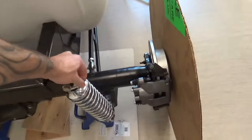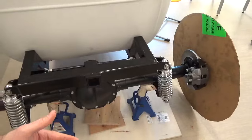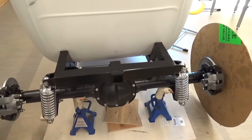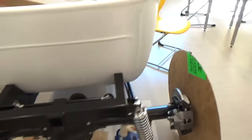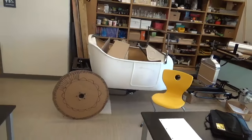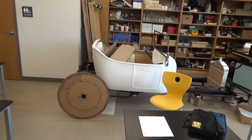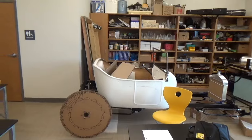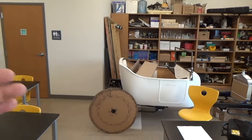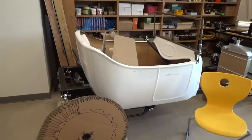The bedside is going to fit over here. You'll have access to the shock adjustment here — it'll come right out. The bed floor across here, we're going to bring it out a little bit, and that's where we're going to decide how far out we're going to come back from the back of the car. From the side profile of the car, we don't want the car to get too long, but we mocked up a tire out of cardboard to get an idea. That's about the size diameter tire we're going to run, and we can kind of get an idea on how far we want that to stick past the bed, or the bed will stick out past the tires to fit in here.